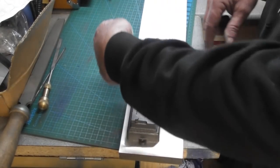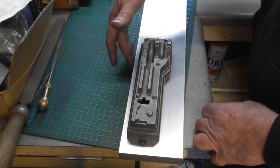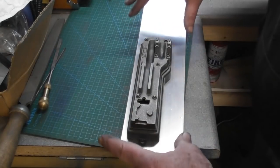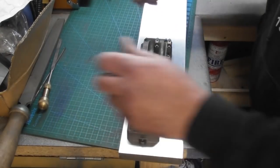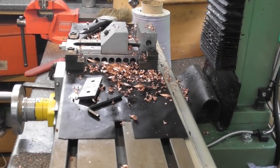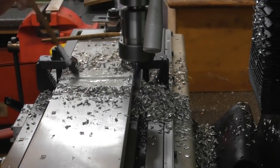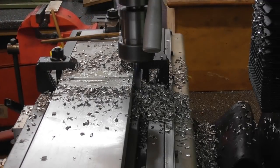Once I've decided on squareness in both directions, I'll machine this piece of aluminium at 90 degrees all round. Then whatever face I tip it up on — if I need to cross-drill — I've got a square reference to the plane. So I've taken the vice off my table for the first time in a long time and put this big piece of aluminium up. I'm just going to chop it to length — four passes at 10mm depth and five passes, basically just chopping it off on the mill.